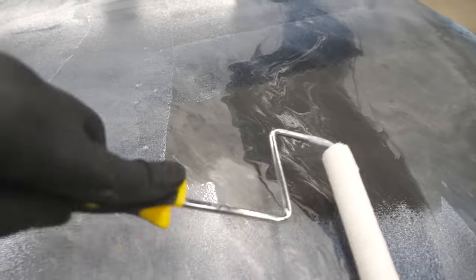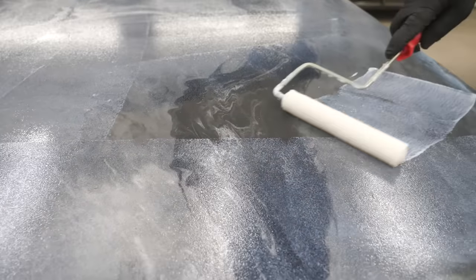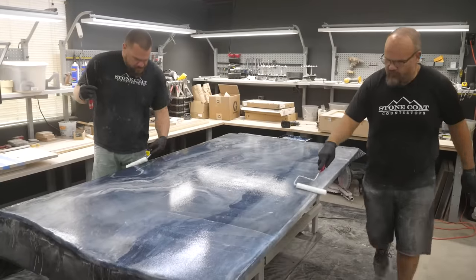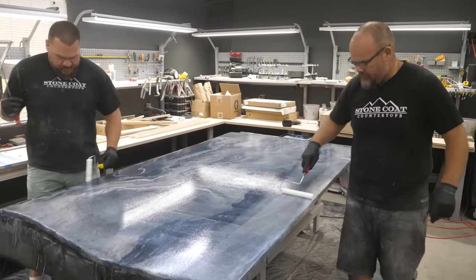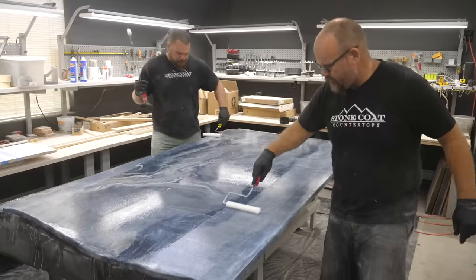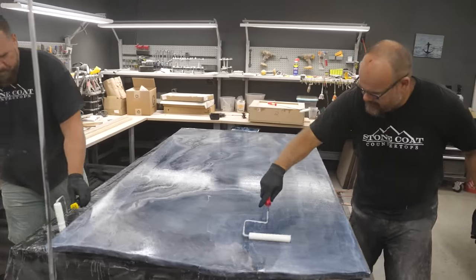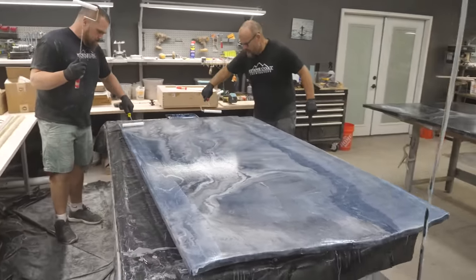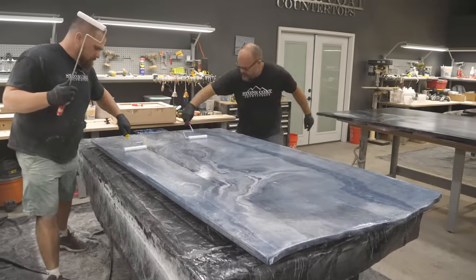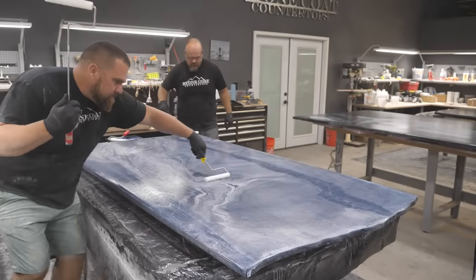And all you're doing right here on this first initial is making sure there is no dry spots. You're getting it on heavier than you'd like. I'm going to use my wet roller to do my initial layout of the material. And by doing this with the wet roller, it does eliminate a lot of saturation that you don't want on your dry roller. Mm-hmm. Gets any big sloppy drip marks off, runs, pools. Here we go. Dry roll.